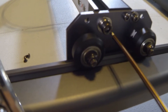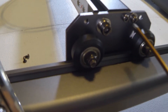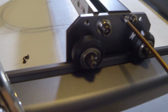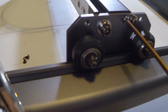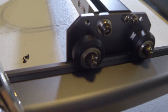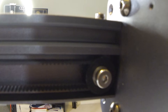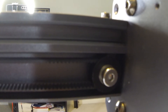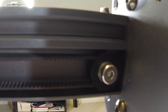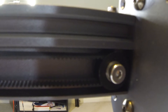Once you have that end cap off, you'll have three screws here. The one you want to adjust is this screw here — it's a 2.5 millimeter screw, and this is what's going to tension the belt up. But before we do that, we have to loosen one more bolt underneath. Looking underneath the frame, you can see one more screw underneath where the belt wraps around the idler gear. You want to loosen that up.